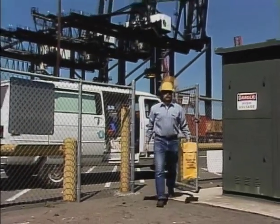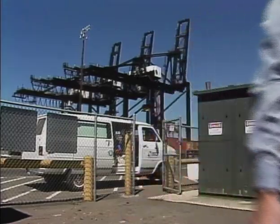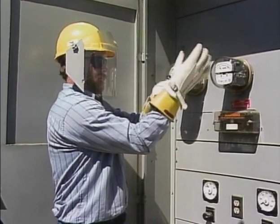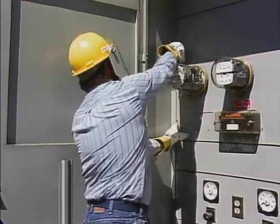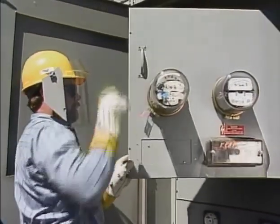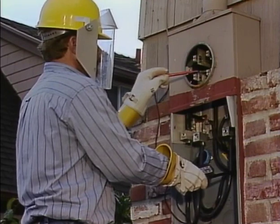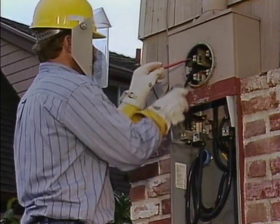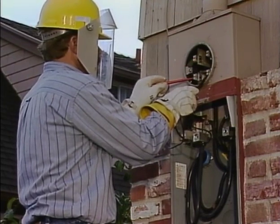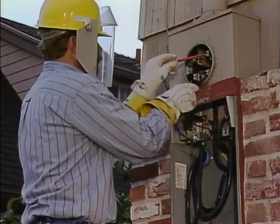You can't see electricity, so you can't tell by looking at it whether equipment is energized or not. And electricity can shock, burn, or kill a victim easily. This is true of the secondary circuits found in most meter installations as well as primary circuits. For instance, if you're working on a meter installation and a fault to ground occurs, the current flow can suddenly jump up to the limit allowed by the fusing on the distribution transformer. So it's always best to be cautious when dealing with electricity.